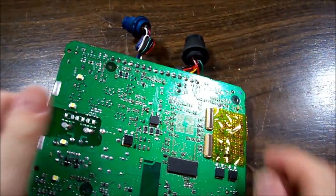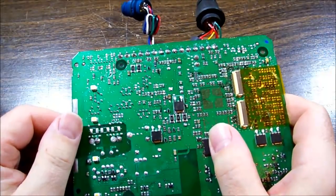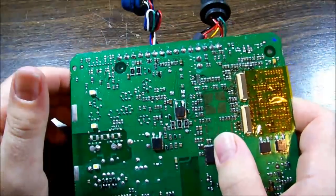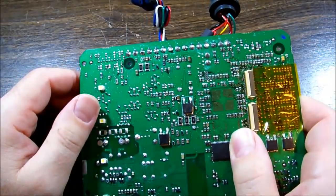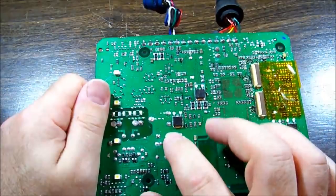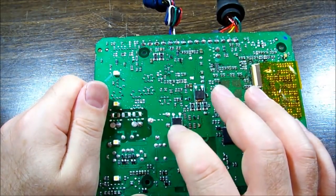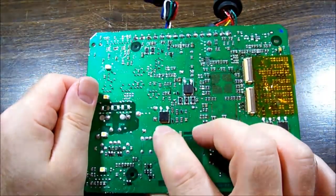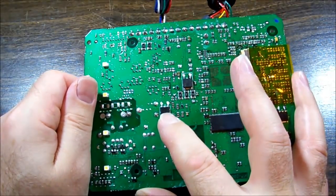Alright, so I couldn't film this part on account of my battery being crap, and I had to use the other power supply to do the test. So I popped it on a current limit of about half an amp, and away it went. And the only thing protesting and getting hot is this. So we need to take that off and find out what it is, and then do a measurement on it to make sure it's happy. But it's the only thing getting warm.